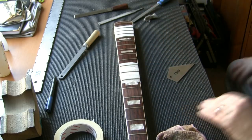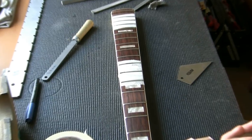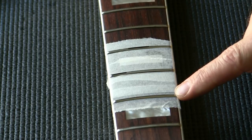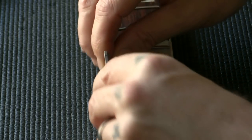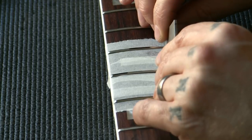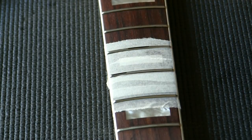I've got a nice thin blue line down the center. I'll then move on to my fine file — very smooth, three ground flat edges, a two-way cutting file. Just across the whole fret following the curve of the neck, always wiping and cleaning the file to remove all the little filings. That one is done — it's level, the curve is back. I'm going to finish it off with a finer crowning file — one side 3mm, one side 2.5mm — this just removes any burrs and puts that nice rounded top on. Now that is the best fret on the guitar.